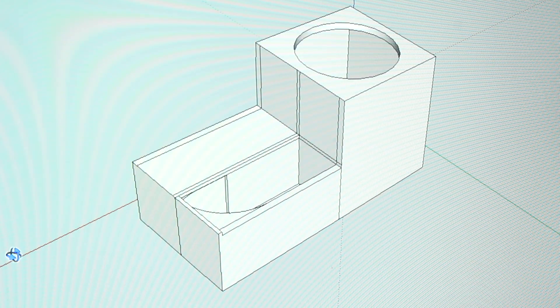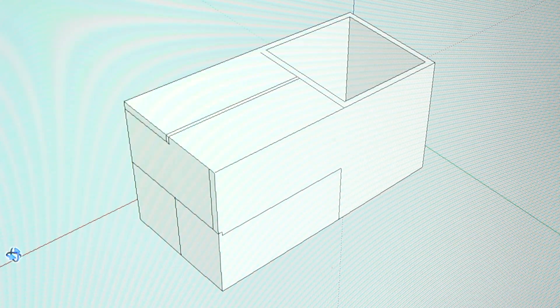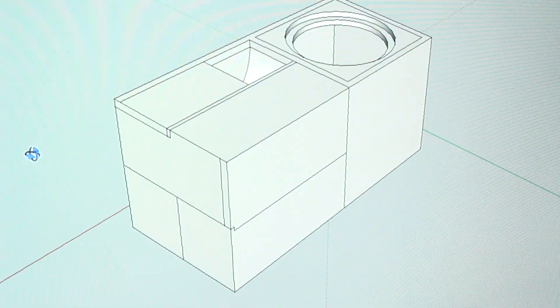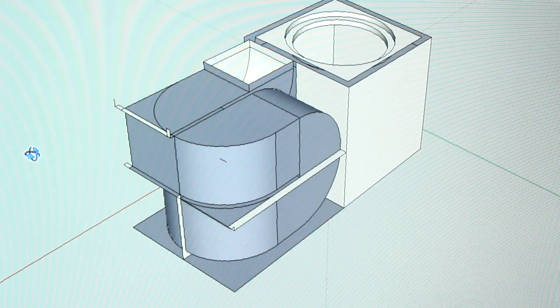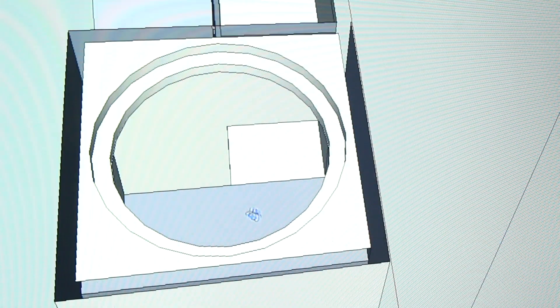You can see this from a slightly different angle here. What I'm hoping is that this will create a huge amount of air pressure inside this slightly undersized box volume, with the huge power from the two 15s on top of each other in isobaric format, which will then drive it through the port, which is very long. And you can see there how the port is made up inside.